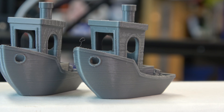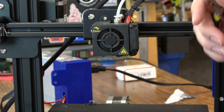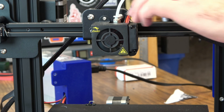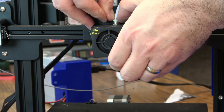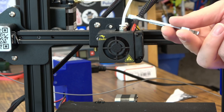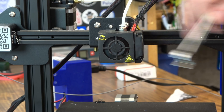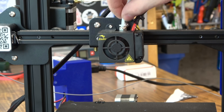Now let's move on to the hotend upgrade. I'm going to preheat once again, remove the sock, and pull out the nozzle from the stock hotend before we start our swap. The nozzle's out. While it's up to temp, I like to pull the Bowden tube — remember, it goes all the way down to the nozzle. Pull your filament out, then get the Bowden tube out. With the nozzle out, push down on the clip and pull the tube out. If the tube gets stuck, you can back the coupler out with a 10mm wrench. Inspect the tube for damage — if it has a hole or has been pinched, you might want to go ahead and replace it. You don't want that causing under-extrusion issues.